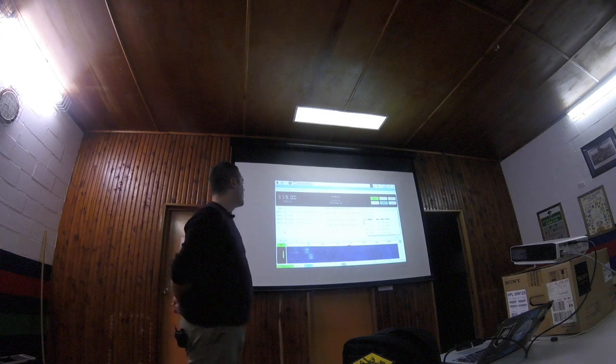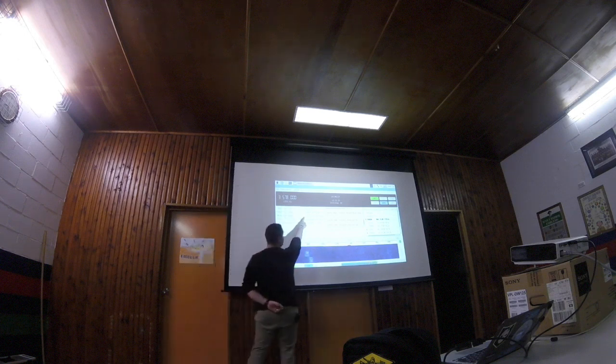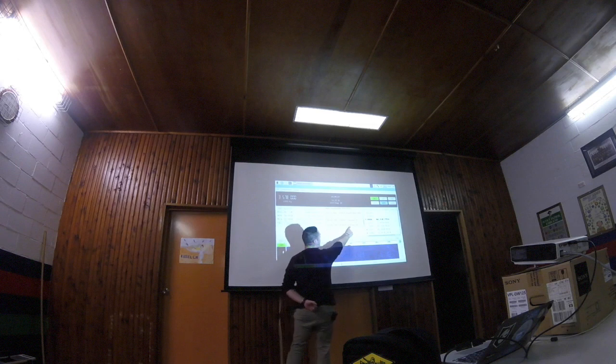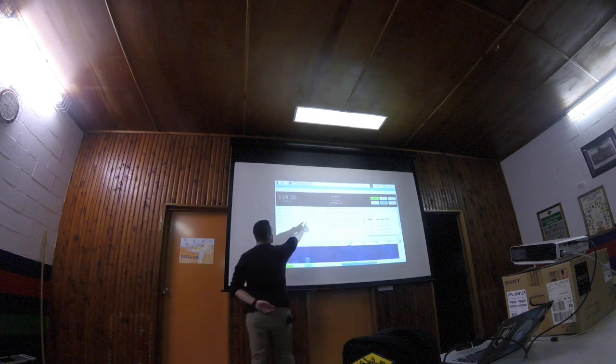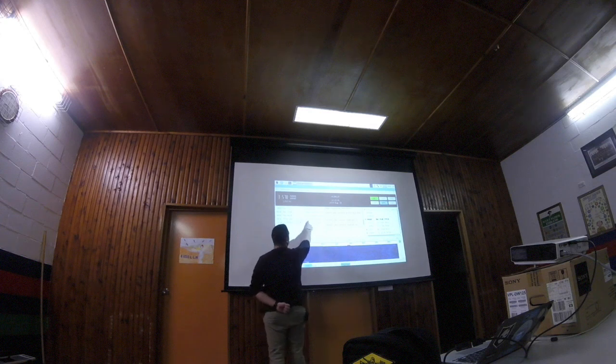Did his signal come up, or is the waterfall the left-hand, what's the left-hand side of the waterfall? So they're all stations heard. So VK3J, this is actually like a decode. These are to me, so these are my messages. So that's why Pete's saying he can hear me plus 4, the 5 can hear me negative 3, etc. But these are what other people are doing. So 3 MCB is acknowledging 3YE on his heartbeat. 3JOX is also acknowledging 3YE. 3YE is sending out his heartbeat, so those ones are responding to him.